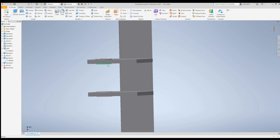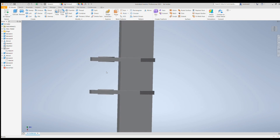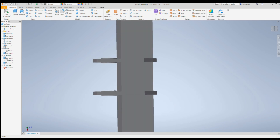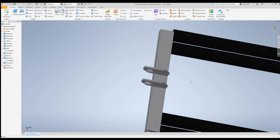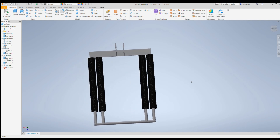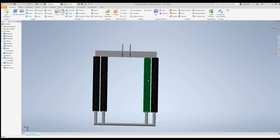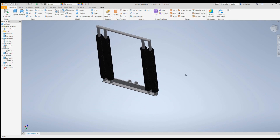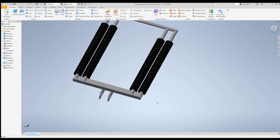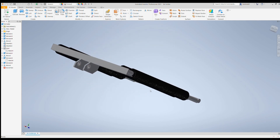In my case this is two inches, so make sure the gap between the two washers can accommodate your bicycle rack. Also have washers from the outside to hold the screws and don't let them rub through the aluminum, because aluminum is soft and it will create damage and definitely strip the paint. On the pipes, I'm going to put pipe protectors — the type you can buy at Home Depot — to prevent the skis from scratching.